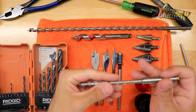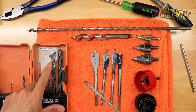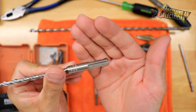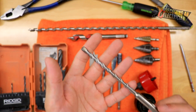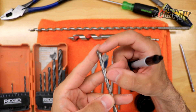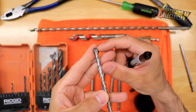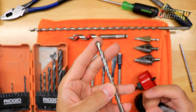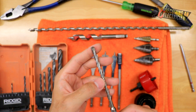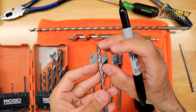Here's how it works: you drill into the concrete, then you put an insert — called an anchor — into the hole that you can screw into. The hammer drill bit looks pretty much like a normal drill bit but it's designed for concrete; it slides as it's hammering in. When it comes to concrete, you don't want to drill a huge hole. Match the hole size to your anchor. There are those little blue plastic inserts, which are not great, and there are also anchors called Alex anchors — A-L-E-X — which stand for aluminum expansion anchors. They're like a little alligator clip and work much better; you can actually screw into them reliably.